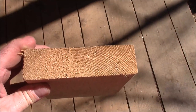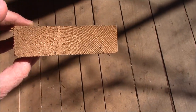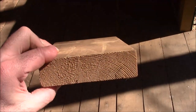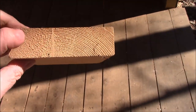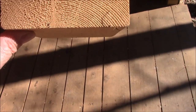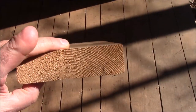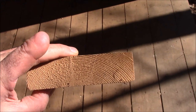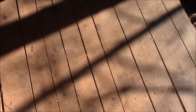When I installed the floor, you can see on this board there's kind of a rainbow — an arch to the wood. This isn't one of them; this was a 2x6 I just found laying here. But I put boards in this orientation — arch down — because usually your cupping is going to cup toward that way. So nailing it down in the middle was to kind of prevent some of that cupping. Whether that had a lot to do with it I don't know, but I did put every board down in that orientation.